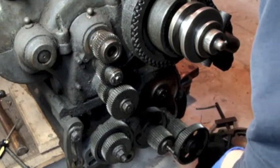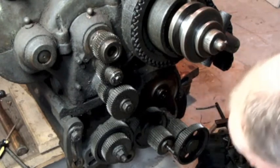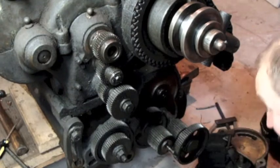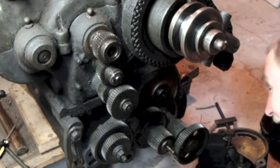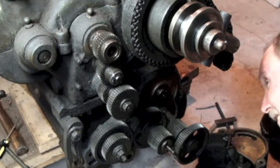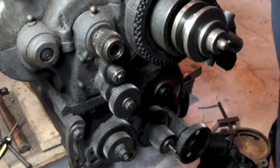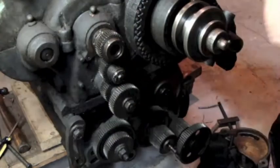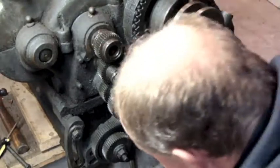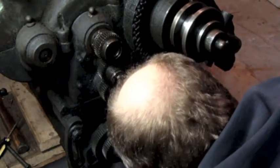With that bracket dropped down, I think I can get onto the two bolt heads I see underneath there. There might even be enough clearance for a socket. There are square-headed bolts, but if I get a 10 or 12-point socket I might be able to find one that fits. There's a 3/4-inch socket, and I was able to get that to fit and loosen the left-hand one. This right-hand one's being a little more stubborn. Actually, the 13/16-inch socket is a better fit — it's sloppy but I can get it all the way down onto the head, so it's gripping better.